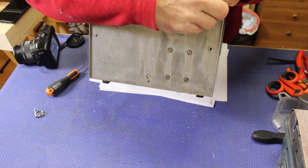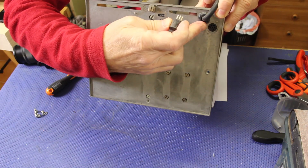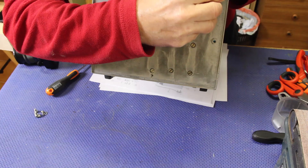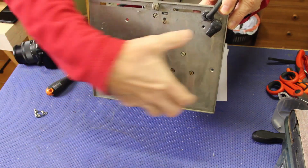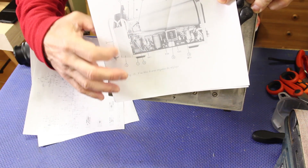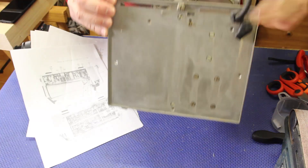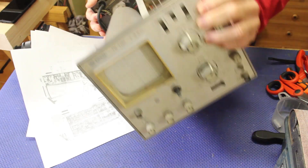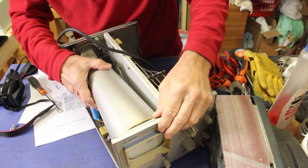...is that through this plug it was possible to power the oscilloscope with a battery - a 24-volt external battery that would have been located here. Here there would be the pocket to store the cord, and attached here would be the battery compartment. So yeah, this was a useful instrument even for field measurements without relying on mains voltage.